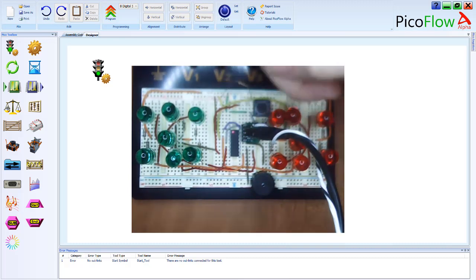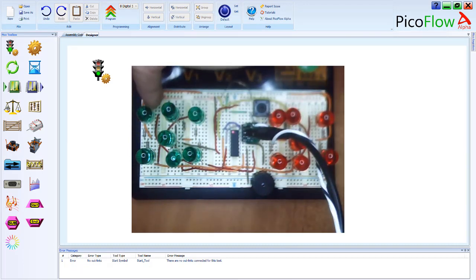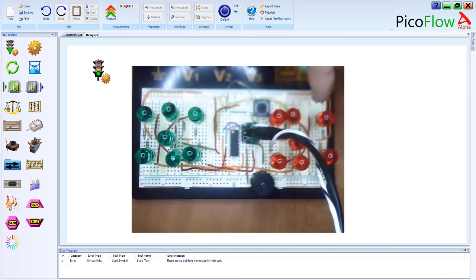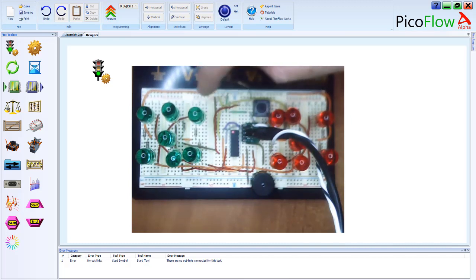As you can see, I've got a stack of components on here because each of the wisher breadboards has these columns. And I haven't seen any other breadboards like this, but this one in particular has 8 columns of rows of 5. And that means that you can jump from one section to the next. They're not all joined, and it's really quite orderly in that you've got the horizontal in groups. So you can space things, and you can see on this one, I've used 2 of these columns basically for the microchip. And then the way I've laid out these dice, I've got 1 column for those 2, 1 column for those 3, another column over there. So it's worked out really quite well.